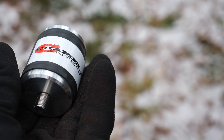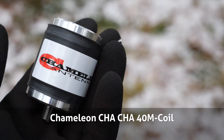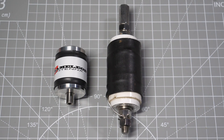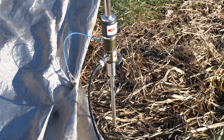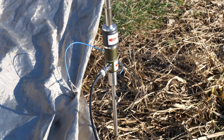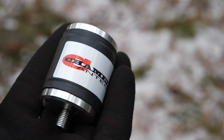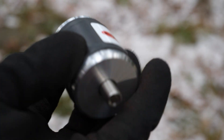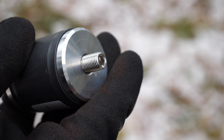The Chameleon 40M coil is an inductive loading coil used to lower the resonant frequency of a vertical antenna and is another item that is part of the Basic Vertical system. The 40M coil is a drop-in replacement for the popular Wolf River Sporty 40 coil — both do exactly the same thing: use the SS17 17-foot stainless whip as a resonant radiator on the 40 meter band. This is certainly the smallest and most rugged of the 40 meter coils on the market. The M coil consists of a 3/8x24 fine thread stud on one end and a 3/8x24 socket on the other.